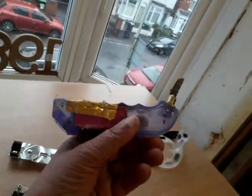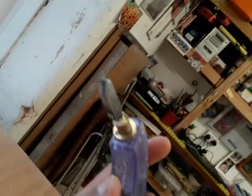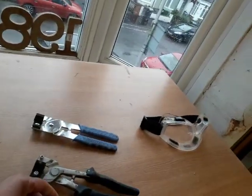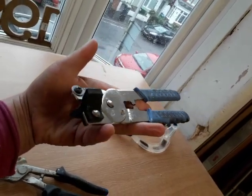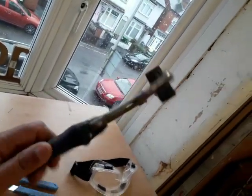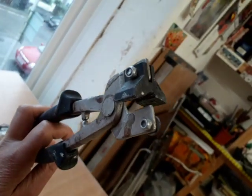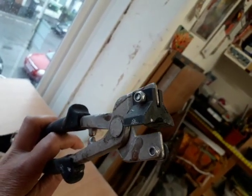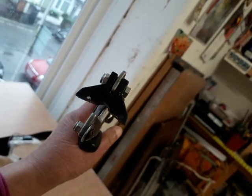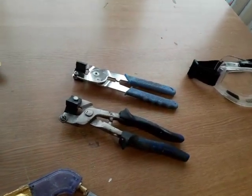We've got the glass scorer. This is by Toyo, but any glass scorer would do. The trick is it's got a tiny wheel, and the tiny wheel helps to score the glass in the direction you want it. And then you've got a score snapper — just a basic score snapper. And then I've got a Vittrex score snapper by Vittrex. I often put the links or the words in on every photograph I've taken. The good thing about these is that it's heavy duty, in that it would cut a really thick tile — apart from really big two-foot square tiles; you'd need a big scorer then.